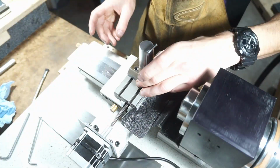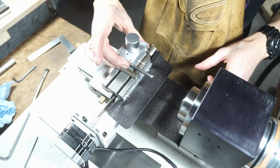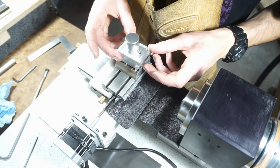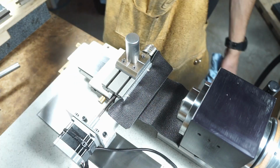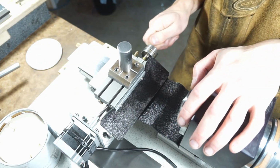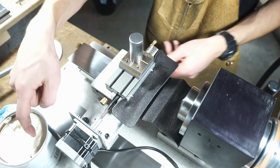I can use tool offsets, so I can basically touch off the tool once, and then it's fairly repeatable. It's not a perfect solution, but I made those slots the exact same size as the little adjustment screws. I'll probably end up milling the ends of the adjustment screws so they fit there perfectly, and that should get me pretty close. Maybe not perfect, but close. Last step was to put a little lithium grease on the screws, and we're good to go again.